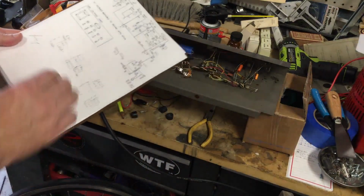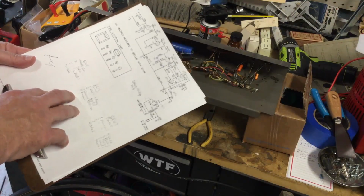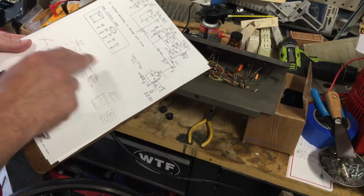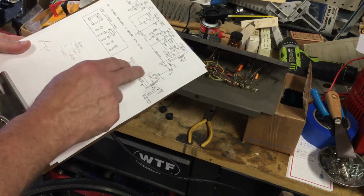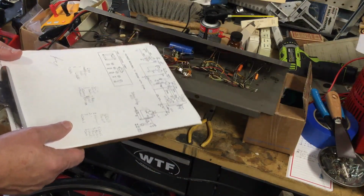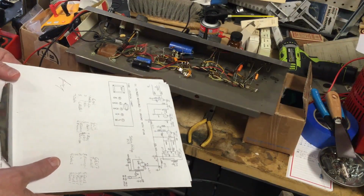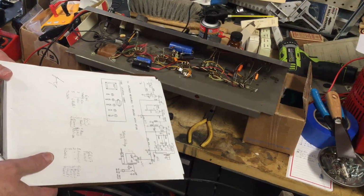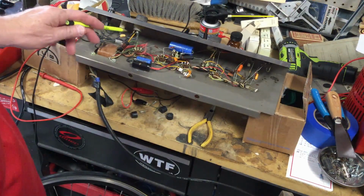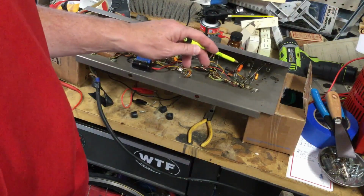One thing to keep in mind with these amps is that if you're used to Fender amps and Marshall amps, you're going to see a lot of different types of tubes. The pinouts on these 6AU7s, the 6C4, the 6X4 not so much, a little bit, and the 6AQ5s are quite a bit different. So don't go around thinking that you'll just check the same pins that you always check for the screens and the grids and the plates, etc., because they will be different. So I went through here and measured with it on every important point for voltage, and measured the resistor values.